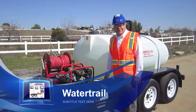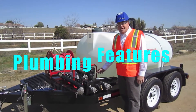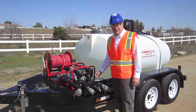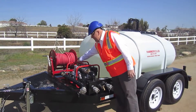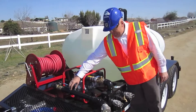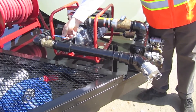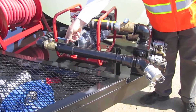Now I'm going to introduce you to all of our plumbing parts, our engine and pump. We use a Honda engine with low oil shutdown protection and a heavy duty contractor grade pump. Everything is 2 inch galvanized — there is no plastic. We use brass ball valves to keep them from rusting, and they're very easy to open and close.